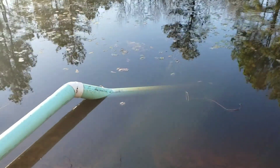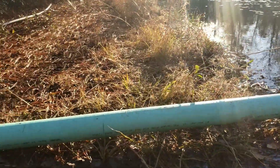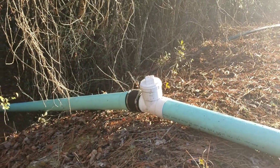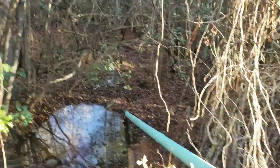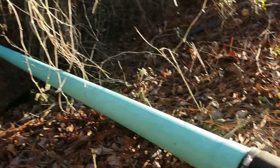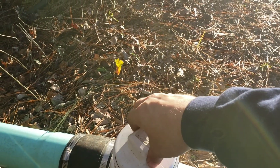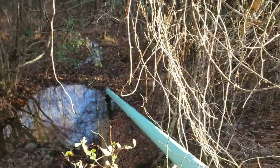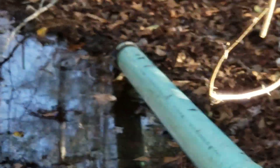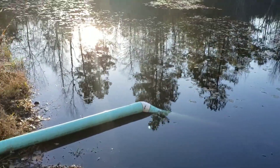Basically what we got is four-inch PVC down in the water, running across the dam to a tee, and down the other side of the dam to the spillway to the creek. What you do is backfill the pipe leading away from the dam, away from the pond, through the tee. Once you get it up to the top, screw the cap back on and cut your bag that you have duct-taped at the bottom of the PVC pipe. The suction created from the water rushing out up to the point of the tee creates a vacuum.